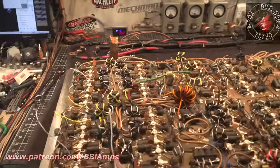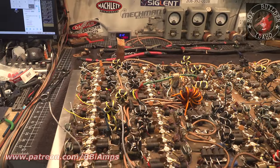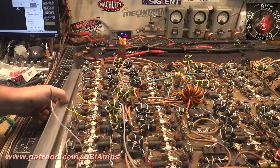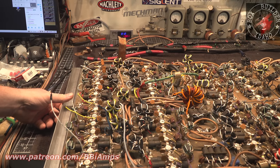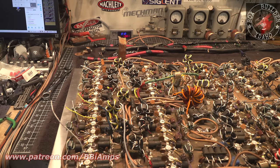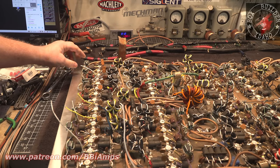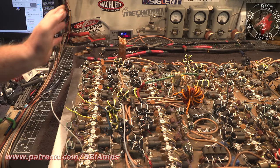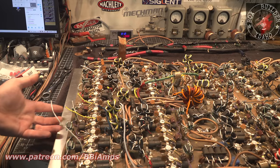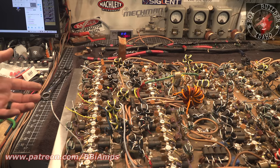But then down here on this end, once again, after we get our distance established from the back wall, I'll slide the heat sink up till it's touching this piece of angle aluminum once we get it squared. And then I'm going to have two little tabs, one that sits down here and one that sits down here, that the back plate is going to screw onto. But we're going to leave the whole back of this open so the air can exhaust with the least amount of air restriction that we can get.